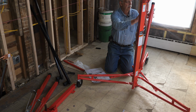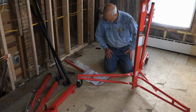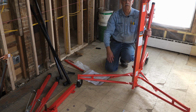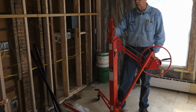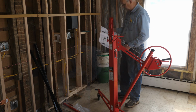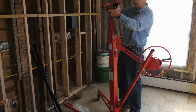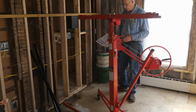Down here. Okay, when it's fully extended away from the frame, release the brake handle and swing the safety hook away so it no longer secures the telescoping sections inside the frame housing. Of course, that's out of camera view, so I'm going to have to re-aim the camera. Turn this around a little bit so you can see this is a safety hook here. Then we attach the cradle to the arm assembly. Now we put in the cross arms.